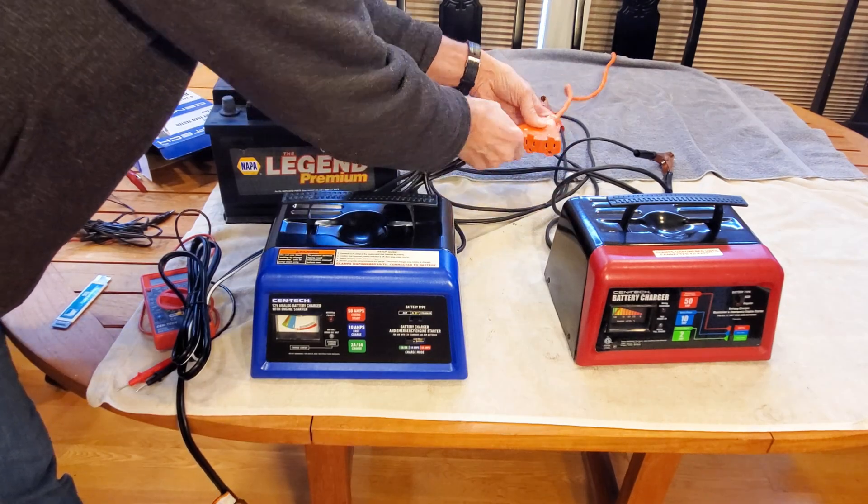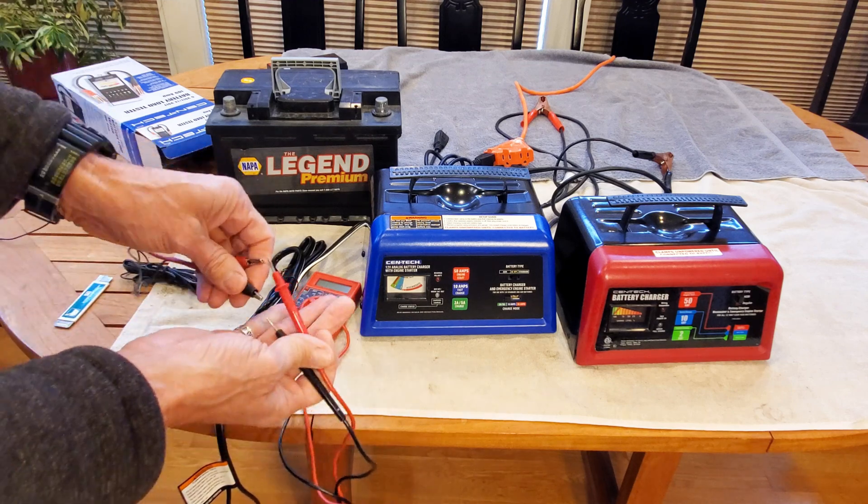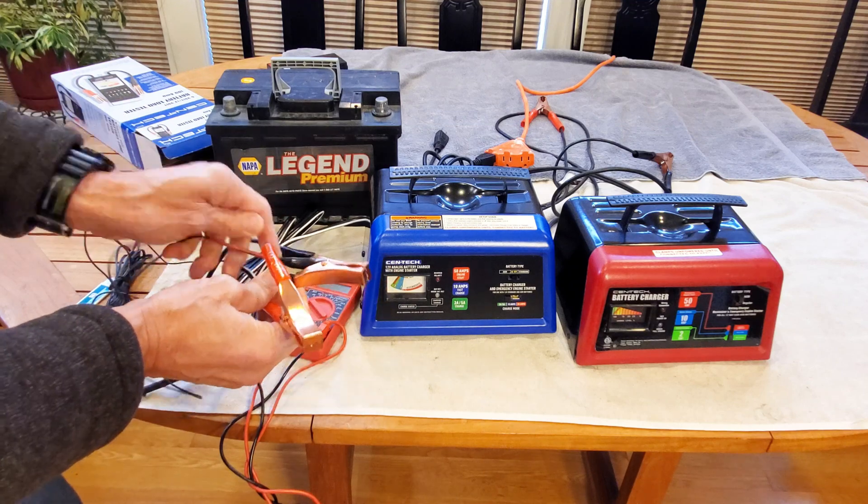When you connect this thing to the power supply we are going to monitor the voltage at the clamps using a voltmeter, with gator clips between the voltmeter and the output clamp so we'll always know what kind of voltage we're getting on the output.